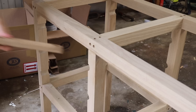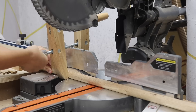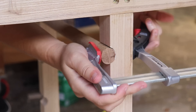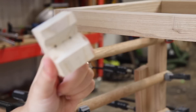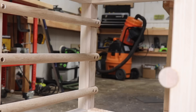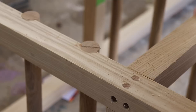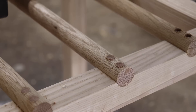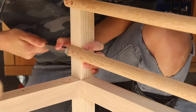After assembly I marked where to cut the dowels, took them to the miter saw — making sure to clamp them since they're round objects — cut them to size and glued them into place. But since there's a lot of end grain in this cut, I was nervous the glue joint wasn't strong enough, so I decided to reinforce it. I made a jig similar to the previous one, drove some nails in the center of a test cut to perfectly mark the center of each dowel, then pre-drilled and countersunk and locked everything in place with screws. After the dowels were secured I flushed them up to the frame with a saw, then plugged all the holes — gluing in oak dowels, cutting them flush, cleaning up with a block plane and refining with a chisel.